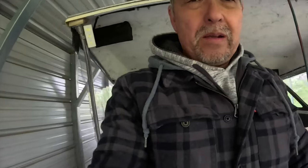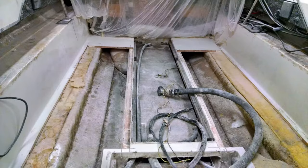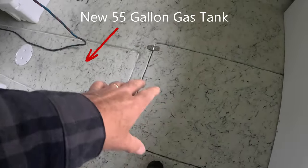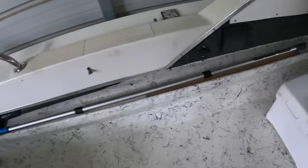Some of the changes I made were pretty big. This thing has a complete new transom back here. It has a new floor - I had him rip out the entire floor, new foam. Stringers were pretty good; he had to replace just one or two back by the bilge. And I had him extend the floor out and make a toe kick. It used to go straight down the entire length of the floor. Now when you're standing in the boat you have a toe kick, standing right up against the gunnel - very safe and comfortable.